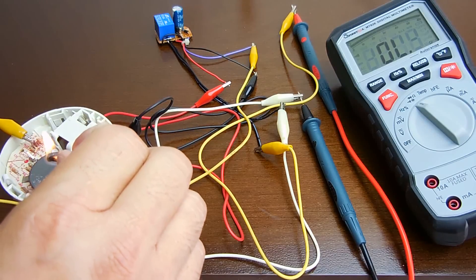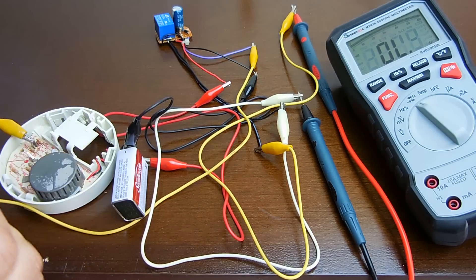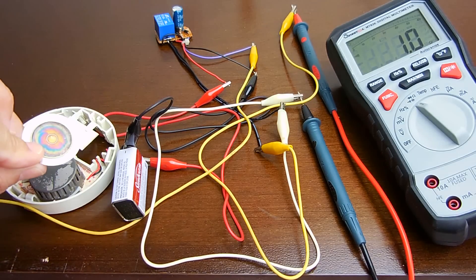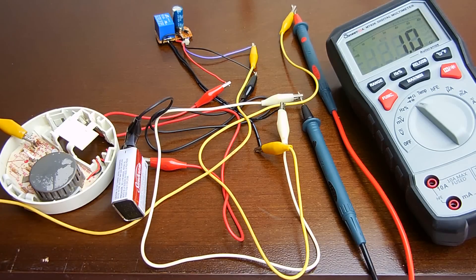This is going to run now for around three minutes even with the smoke cleared away from the chamber. This would normally be off — you wouldn't hear it sounding anymore — but the relay remains on. Any second now this should be turning off... there you go, it turned off. Now we're ready to go again. Another event of smoke would reset it all over again.